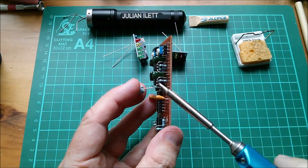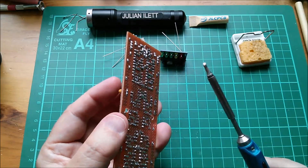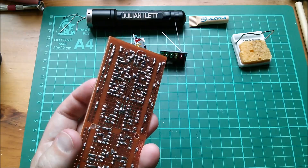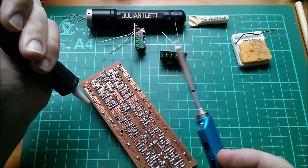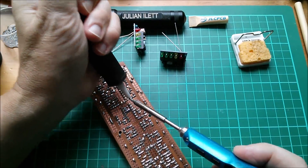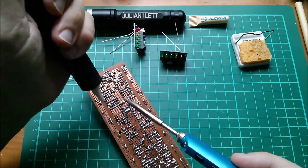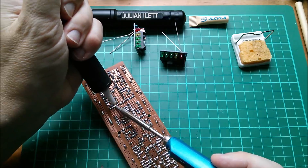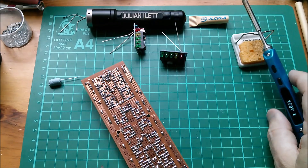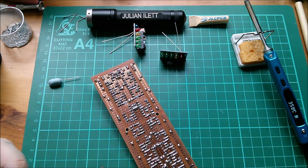I've put a little handle on my piece of wire made out of blue tack, heat that up and whack — I wanted to waggle it in and out. Oh, it doesn't really work does it? Okay, solder sucker it is. Solder sucker on single-sided boards — it's always dodgy isn't it because you can remove the copper. You're always a bit nervous of doing this because the traces, the tracks, are only glued onto this SRBP board. They come away really alarmingly easily.